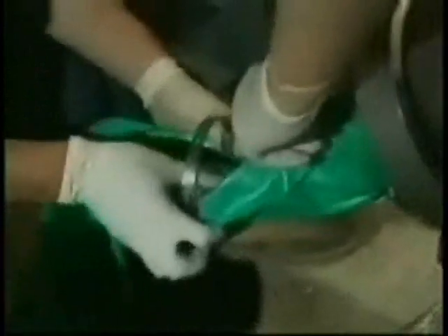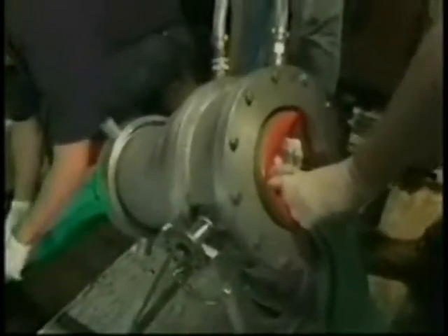How do we get the resin into the pipe? We're going to bring it over and pour it into this liner. What's this green sleeve going to do? This is more or less like a guide tube that we're going to use just so we keep it in there, hold it in form, and we don't spray it in the air. Brian's going to put that guide tube over the fitting and we already have the liner hooked up to the air gun, so we're ready to go. I'm going to start fitting it down slowly until we get it into the fitting.